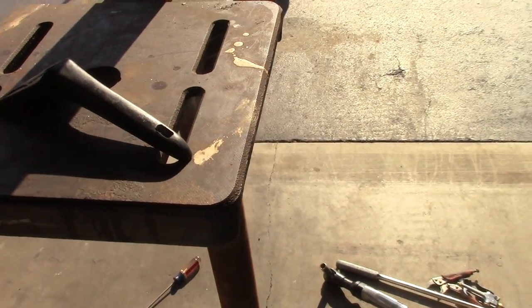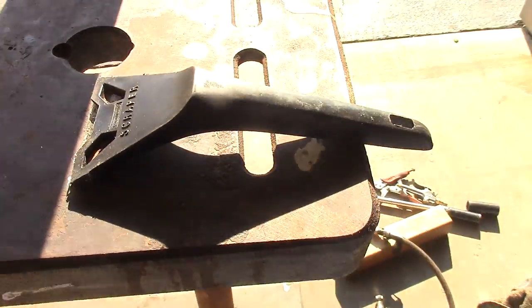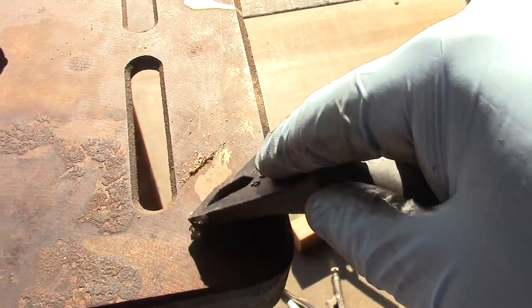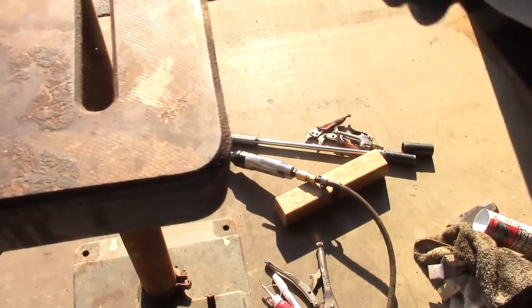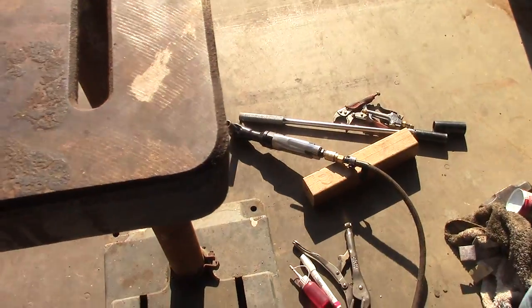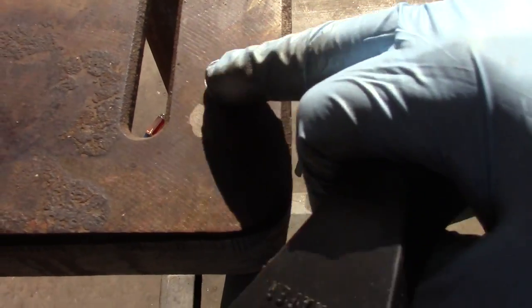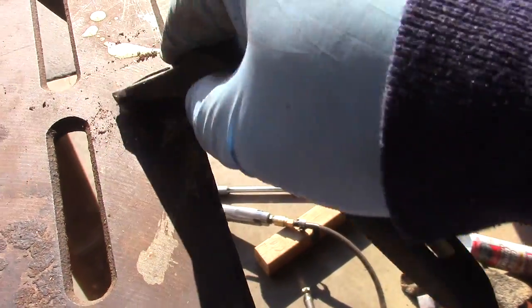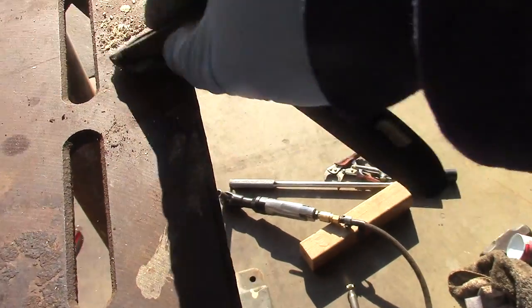Now I'm taking a look at some of these paint stains before I remove the table. It's going to be easier to scrape this off. I set it to a good height and I'm just using my glass scraper. This paint is just sloppy — you drip paint and leave it there. But underneath that paint is steel and you can see it has nice machining in it. So I'm just going to scrape this off before we go to treat the rust.